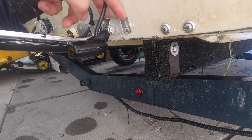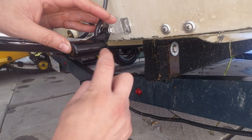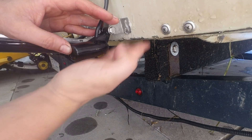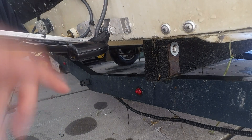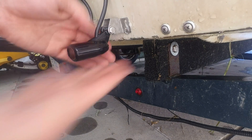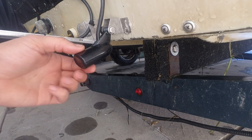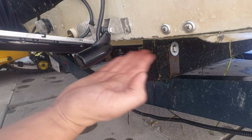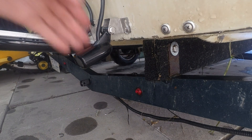The other thing to check is whether your transducer is installed at the right height. I like to have the reference line flush with the bottom of the hull, so you've got about a quarter inch of the transducer below the hull — that way as water comes up it's always in the flow. If you're losing it at speed and it's level, try angling it in one notch; that gives a cleaner flow of water over it and tends to give you a better reading.